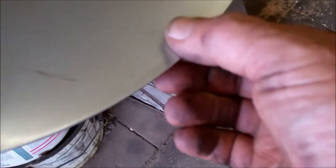Before I tack weld these on, I'm going to grind a bevel on the outside corner of the rim. So it's beveled downwards slightly towards the outside, because the circle cutting machine tends to form a slight radius down on the edge. So I need to form the same shape on this rim. Otherwise, when I come to weld the inside corner, there's going to be a little gap.